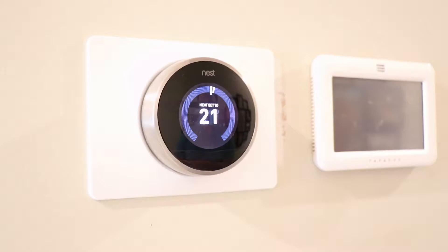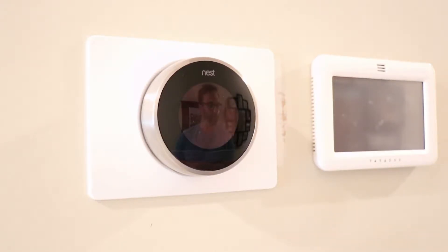You're going to want to make sure that you don't have stranded wires in the wall. When I went to install my Nest thermostat, the previous owner had installed the old thermostat using stranded speaker wire, so I actually had to pull out that wire and install a proper solid core thermostat wire — that's 18 gauge.